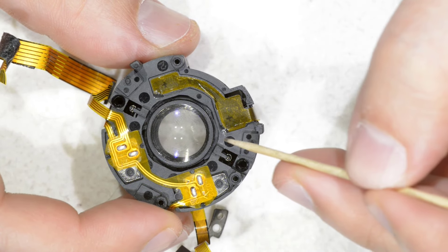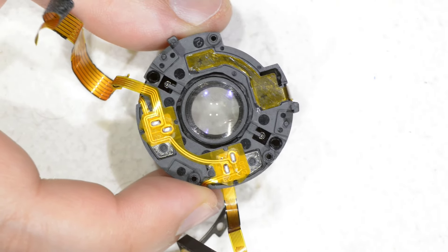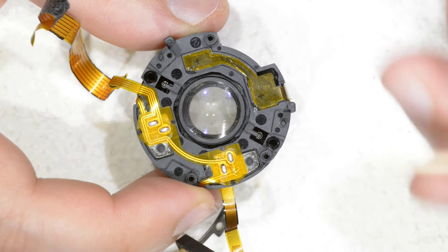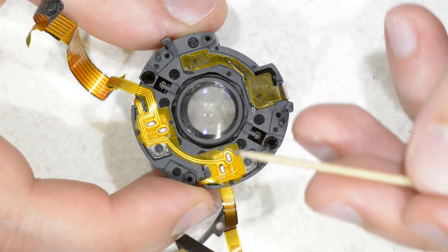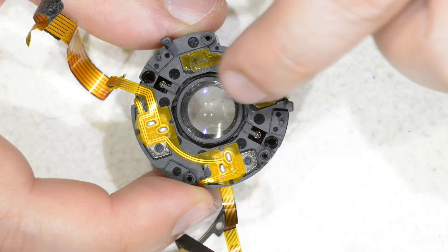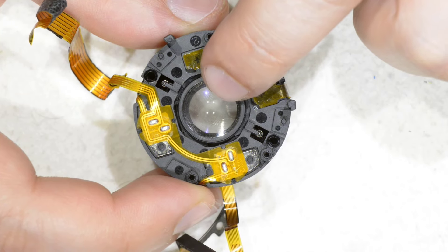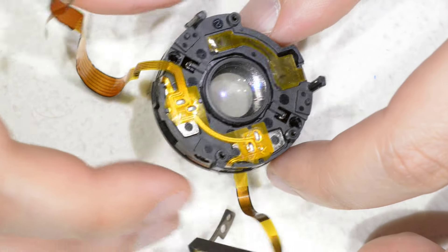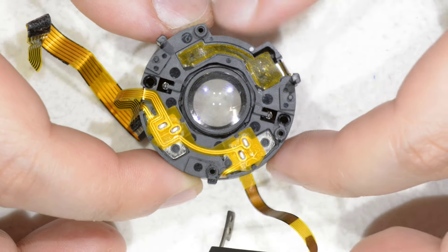Finally, my guess from the reference is that there are some accelerometers — sensors that measure acceleration — that feel the shaking in your camera. They send a signal to the coils so the lens element is going to move in the opposite direction, trying to keep the image stable. And this is how it works — it is extremely simple, actually.